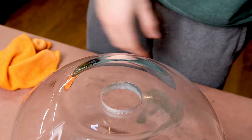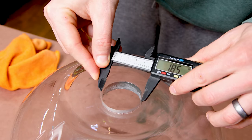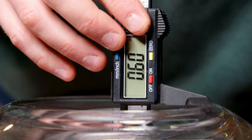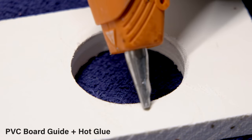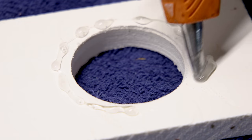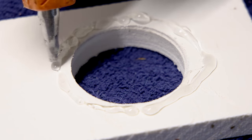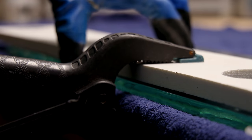For that build to work properly, I had to drill a hole in the bottom. Moving forward to present day, that feature must be reversed. The bowl was made from glass, so I'll patch it up with the same. I took measurements to determine what glass to use and to create a guide for the hole saw. A little hot glue allowed me to create a gasket of sorts between the pieces. This will help retain the water, which keeps the hole saw from overheating. A spring clamp will keep it stationary while I drill.